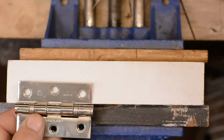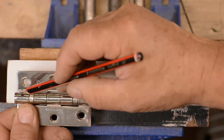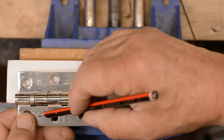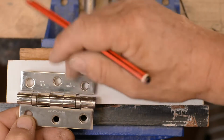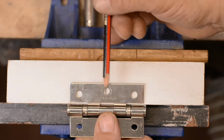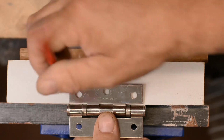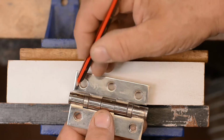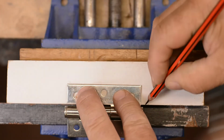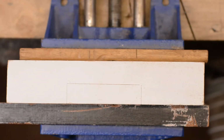So right, if you see the way the hinge is made, it's got 2 leaves. As you can see, there's gaps in between that side, and these are filled in. What we do, the one with the gaps in, we normally have it to the door. And instead of butting it up straight to the timber, which can cause a binding and creaking when the knuckles rub against the door, with that little gap there, I'll put that to go round with a pencil. That's going to be your outline of the hinge.